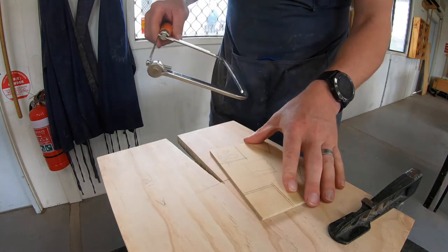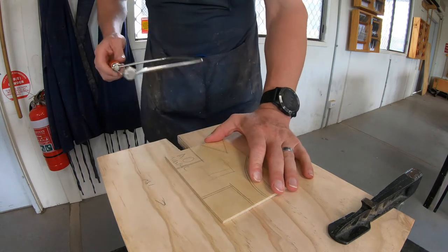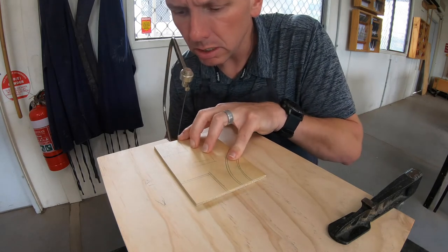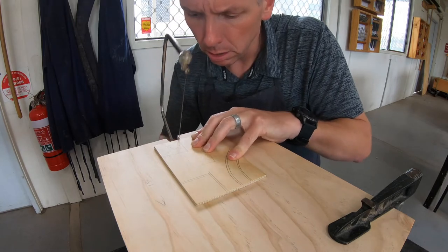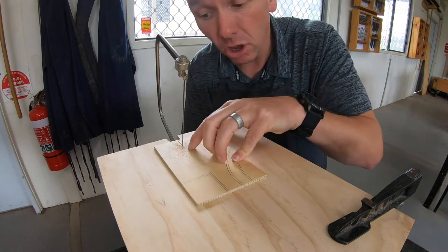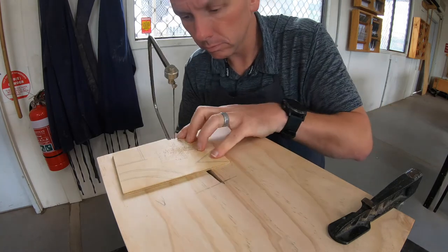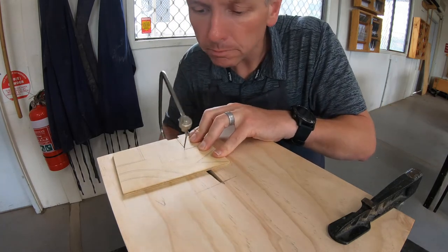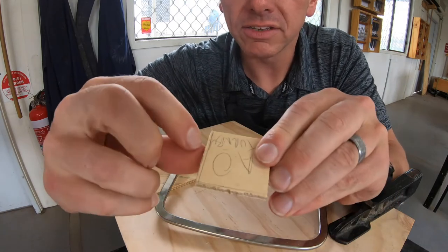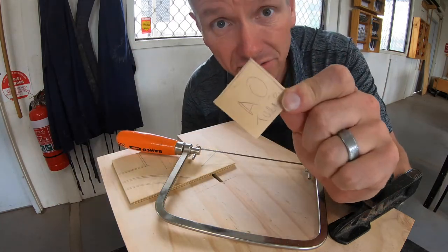All I'm going to do is start cutting along the outside of my pieces. I like to get down a little bit lower like this and just use your finger, putting it on the edge there. Nice and smooth, just going along and cutting on that outside line, leaving a little bit of a gap. I'll cut all the way through. There we go — I have my piece. Now you can see it leaves a little bit of a jagged edge, and you can see that I've got to sand it off on the disc sander just that little bit. That is absolutely perfect and it should be the exact size that I need it.